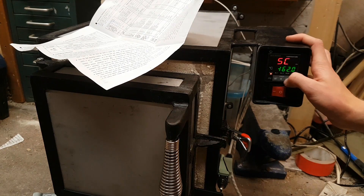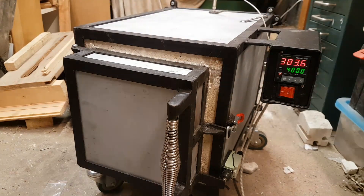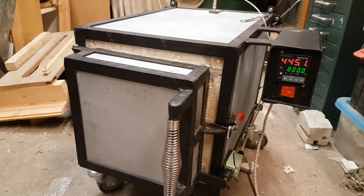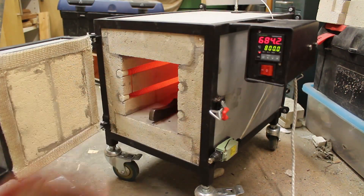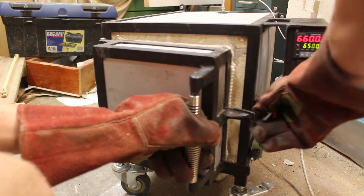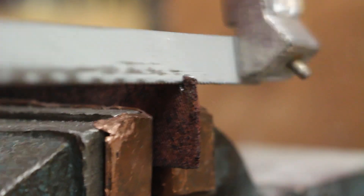The PID controller has a self-calibration mode where it works out all the different parameters for heating and cooling of whatever system you've plugged it into. You set it up at whatever temperature you think you're going to use it, put it on self-calibration mode, and it heats up and cools down in two different cycles. Then it knows exactly what parameters it needs to use, which means it can hold the temperature really accurately. I set this temperature to about 800 degrees Celsius. I decided to use it to normalise and anneal a metal file and another knife I was working on. The oven holds the temperature at 800°C very accurately, never moving more than 2 or 3 degrees from what you've set it. I left the metal to soak for a couple of hours, then decreased the temperature to 650 degrees, left it there for a while, and then let it cool down overnight. After annealing, this file — which would have been impossible to cut with another file before — is now so soft you can easily cut it with a file and with a hacksaw.